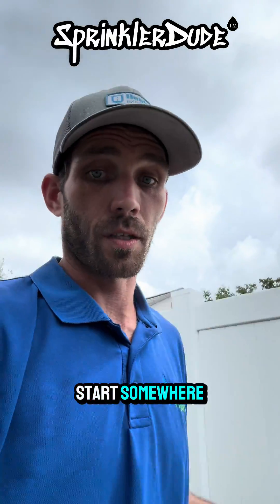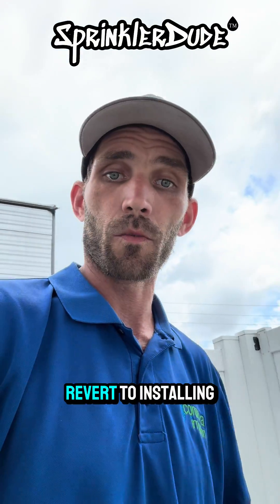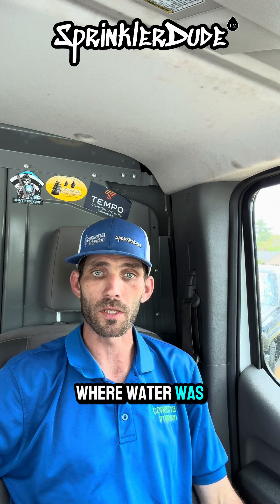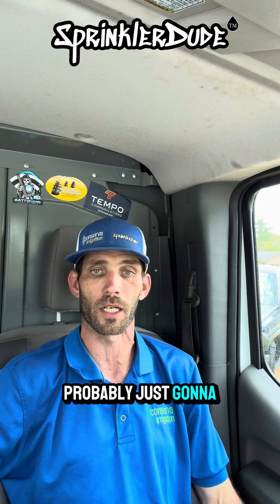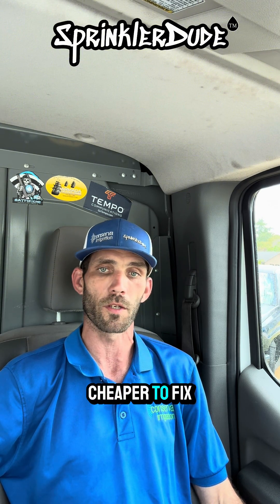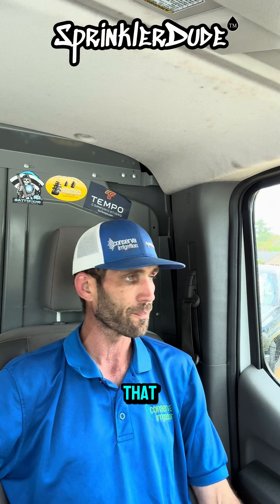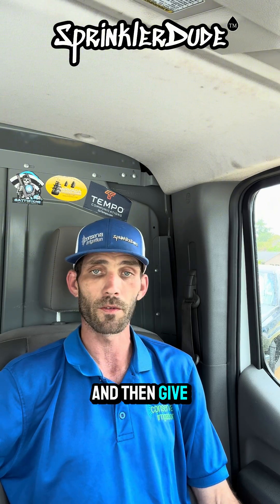So far we've got two sprinkler heads — we've got to start somewhere, fixing heads to see more heads pop up. If it gets to a point where there's not a lot going on, we may revert to installing a new system. Sometimes troubleshooting the existing system ends up costing just as much as a new system — that's only zone one out of four. Well, I found about nine spots where water was leaking out where sprinkler heads used to be. This is going to be a phased approach: phase one, replace those nine sprinkler heads — actually, I'll cap all nine of them, then go through their respective zones to reveal whatever else is broken. A new irrigation system for a four-zone house on a half-acre lot is right around ten thousand dollars. Repairs on this system won't be anywhere near that. We're going to start by upgrading the controller and the valves, cap all nine heads, and then give the customer a phase two proposal.